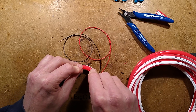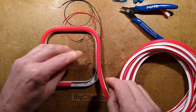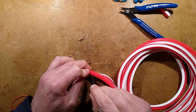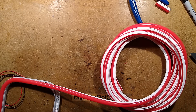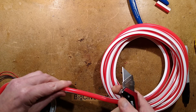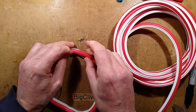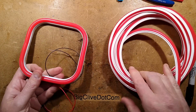The fact that you can just cut the strip to the exact size means it doesn't have that constraint of scaling to fit the cut point of standard LED tape. I'm going to butt this up to here and make a little mark with a Sharpie — a Sharpie's probably not terribly high resolution for this, but it's what I've used. I've just lost the lid of the Sharpie — oh, there it is. I shall put that on before I end up with a dry Sharpie, then get a sharp knife and cut this in a straight line like that. Can it butt up alright? That's not bad — that is not bad at all. Let's light it and see what it looks like.